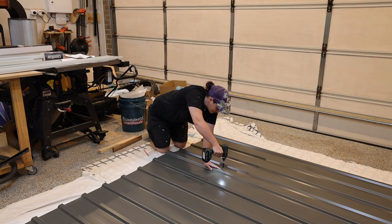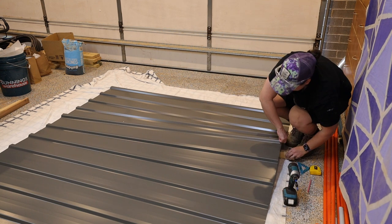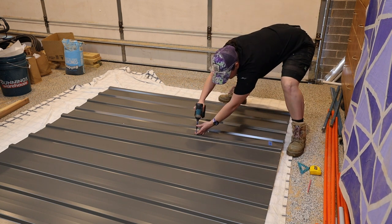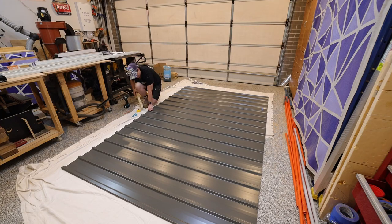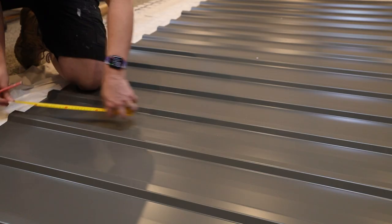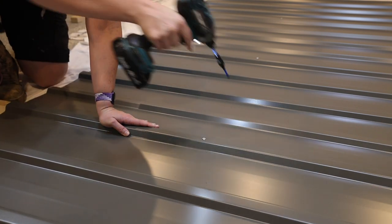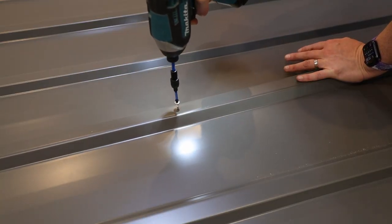This project was quite the rollercoaster. The engineer was with me each step of the way, as this is definitely a two-person build. We started with the back panel — you'll never see it, so it was a good place to learn the process. The instructions give you pictures to show where the screws go but nothing is pre-drilled or marked, so you only have black and white images to go off. The self-tapping screws require quite a bit of pressure to bite into the metal. As per the instructions, placing a block of wood under the metal close to where you're drilling does help — just don't put it right under the screw or you'll secure the wood to the metal.